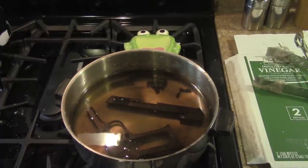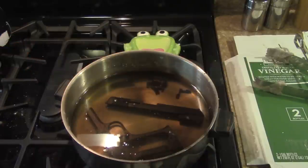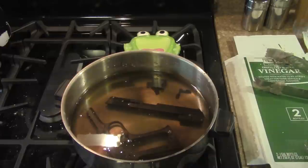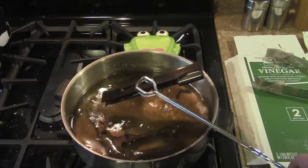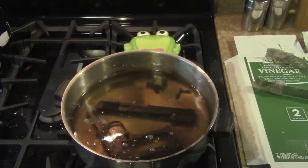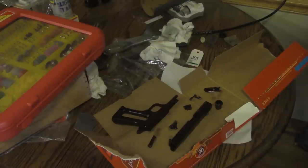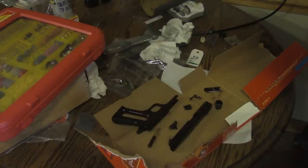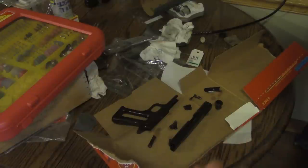The parts have been in there about 20 minutes now. The bubbles finally stopped and you can see the parts have taken on almost a mirror-like, shiny finish — kind of like those cheap knives with a rainbow color to them. But they're starting to get a nice darker blue to them. It actually ended up taking closer to an hour rather than half an hour. I think I was cooking it a little too low so it wasn't bluing, because it's a time-and-temperature process for coloring the metal.